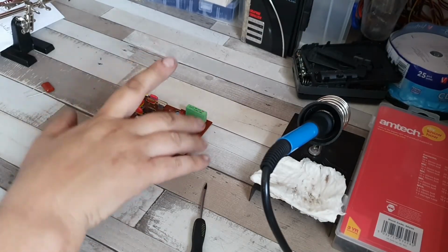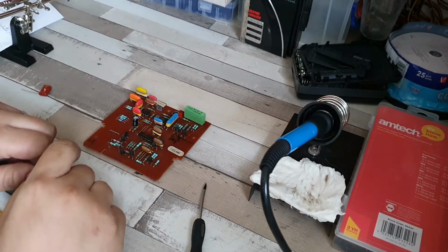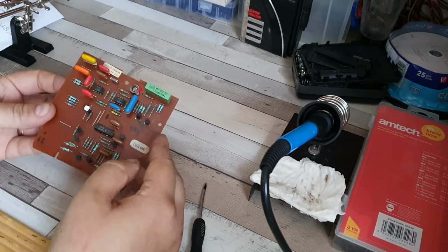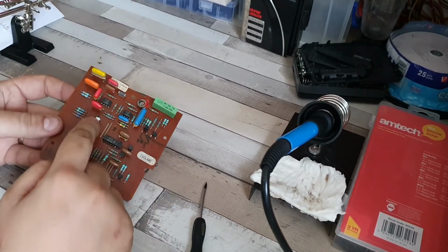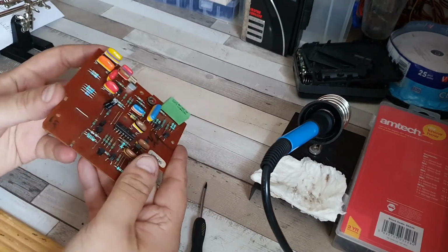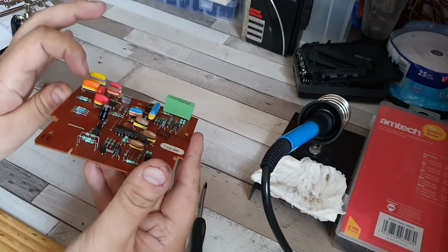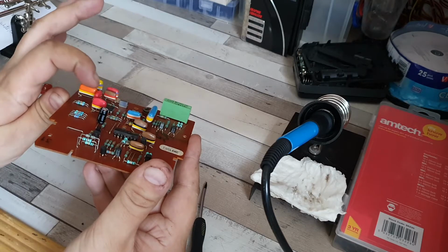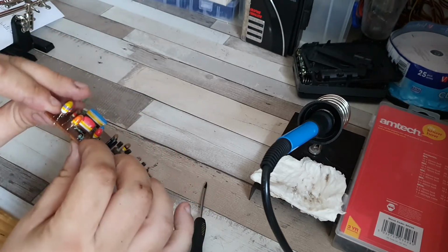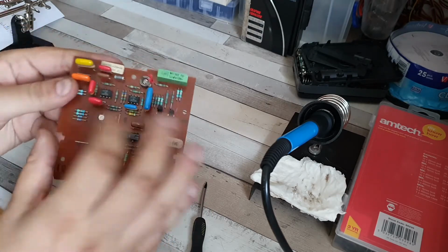We're looking at this tuner board from the, I've completely forgotten what it's from, the V2000 unit. There were a couple of capacitors I wanted to replace. So I replaced this one last time, and I wanted to replace these two. Firstly because this one has a little bobble on it, which might be absolutely fine. In fact, this one here has a slight ridge. But also this one because I've bitten a chunk out of it, and also there's a little chunk out of this one as well, which is the other reason for replacing it.